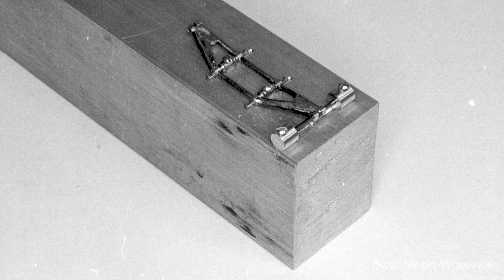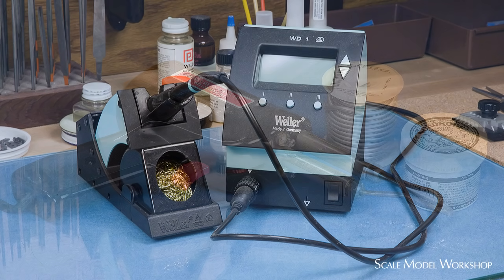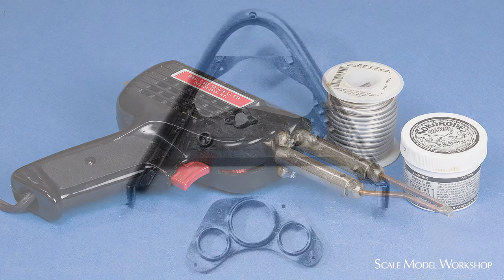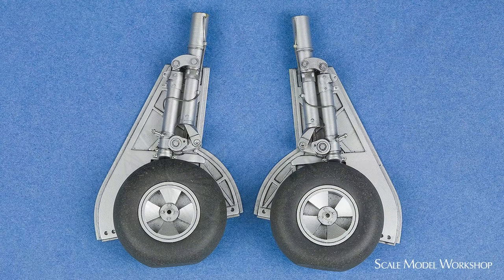So in this case, I needed a lot of heat. Soldering irons like this are designed mainly for the electronics field where the componentry is small and the temperatures are critical. It's a nice setup for a lot of small modeling tasks. And if you're mainly working with wire and photo etch, this type of iron would be my first choice. For larger parts, you'll frequently need a larger heat source like this soldering gun. I do the majority of my soldering with a soldering gun like this, and in fact all the soldering on these parts was done with this gun.